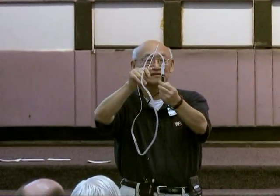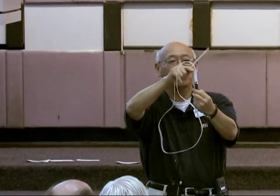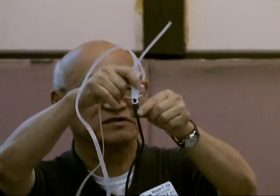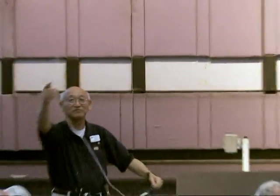It's not even cut to the right frequency, but basically it's a piece of twin lead and you just make a J-Pole out of it. You normally would just tap up on it for a stub, but just to make it easy to build, I just took a piece of wire and folded it over to make a little stub out of it, to keep the RF from coming back down on the coax line. I put some beads over here.